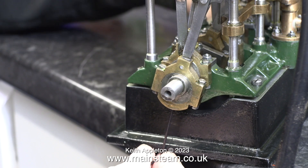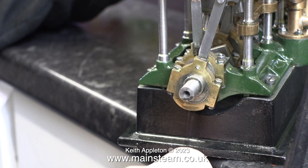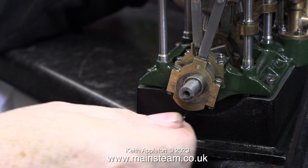In this clip I'm setting the valve timing for the high pressure cylinder. This is really difficult to do. If you look carefully at the eccentric sheaves — that's the part of the eccentric that fastens to the crankshaft — you can clearly see that they are not 180 degrees relative to each other. This is always a problem for me.